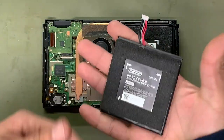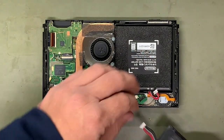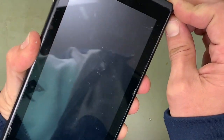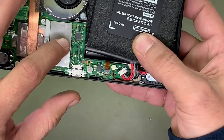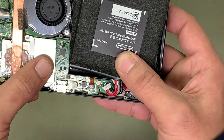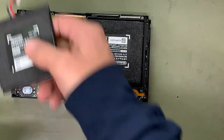First thing I like to do is go ahead and grab me a good battery. That's my good known working battery. Charged 100%, I know. Let's see if this thing even turns on. Nope. Okay, well it's actually not a good sign at all. Usually even if you have a bad charging chip or video chip, well, you could have a bad video chip, so you may not be seeing video. Well, let's run through a few troubleshooting steps, see what's going on.